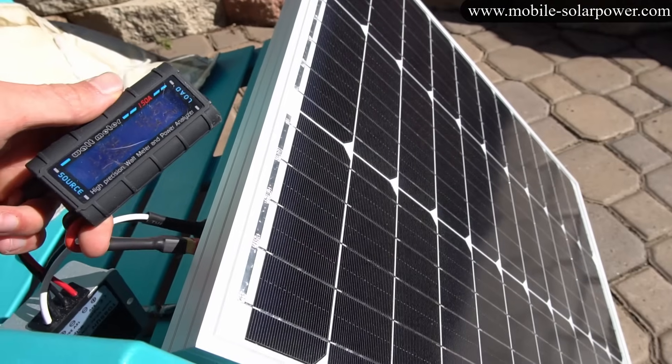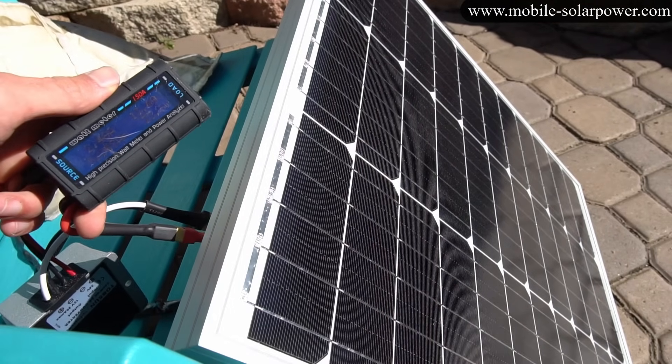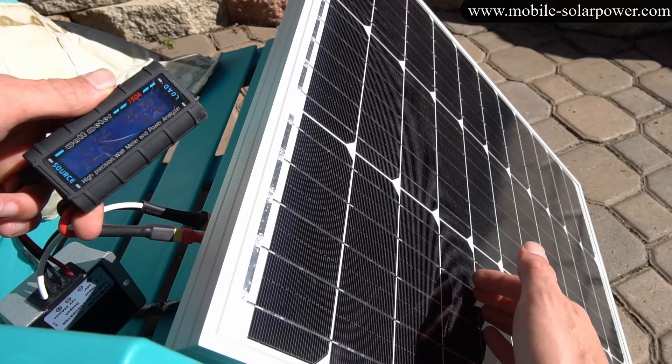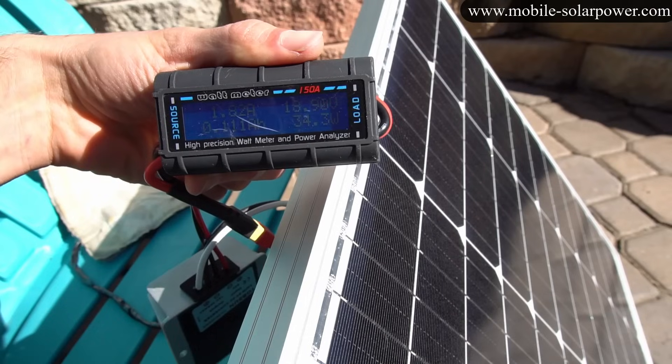This is because these solar panel cells are wired in series, so if you cover up one of them it will affect the whole chain. If you are wiring up a system, understand that if one part of your panel is shaded it will significantly decrease the power output.